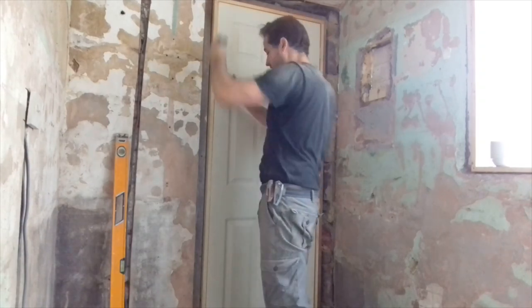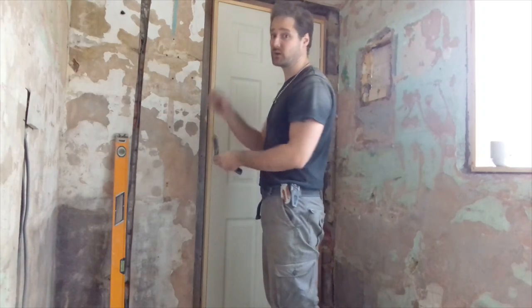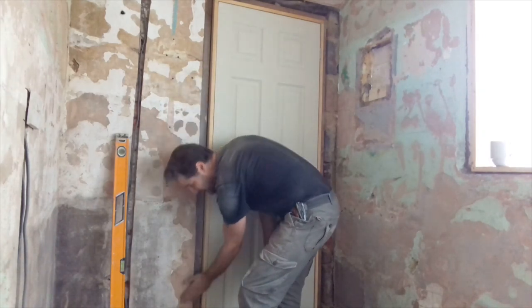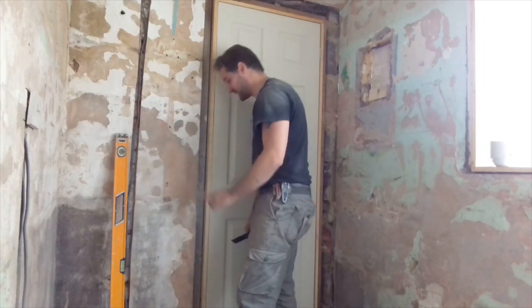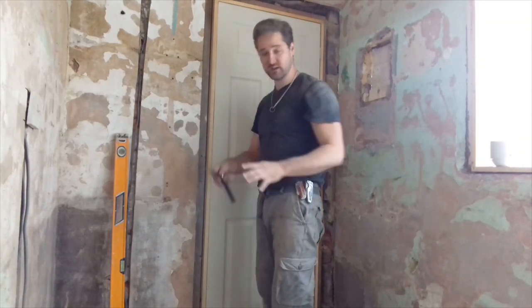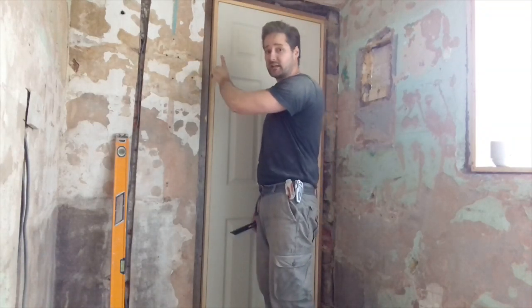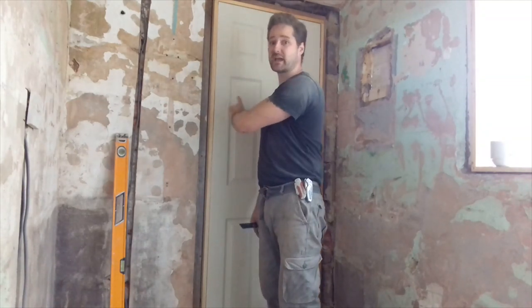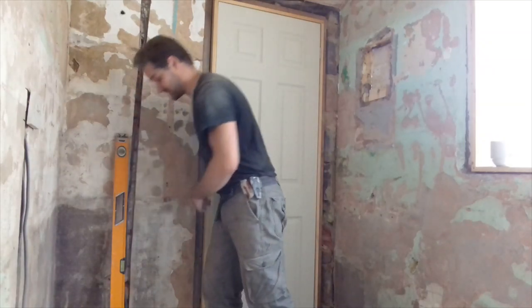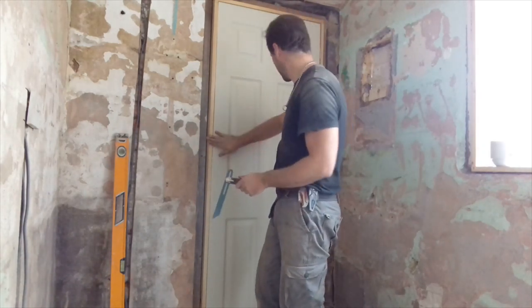So what I have to do is fix the top one, shut the door, make sure it all lines up again, open the door, fix it, shut the door, and repeat the process as many times as I need to until I know the door is spot on. Because at the end of the day, it doesn't matter too much if the wall's slightly warped down here, because it actually bows out quite a fair bit. You don't have to worry too much about that, because when you put your architrave on there, your architrave will cover that up — that's the whole point of having the architrave, it disguises any unsightliness. What will stand out is if the frame is wonky to the door — that will stand out more than if the wall is slightly skew to the architrave, because the only way someone's going to really tell that is by looking right down the side, and no one's going to do that. So this is the important bit — make sure that is true.